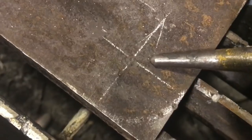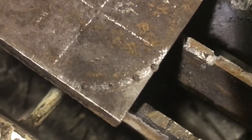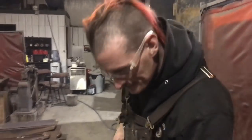Center of our bolt holes. I'm radiusing the outside corners near here. And this inside corner here gets welded to a piece of angle iron, 2x3/8. Then that will get welded to the bumper. And this is what the plow bolts are to.